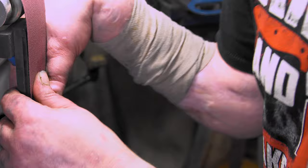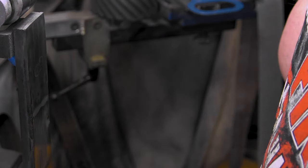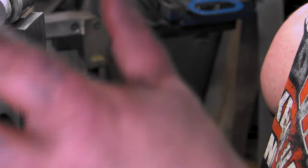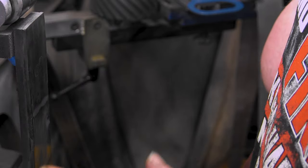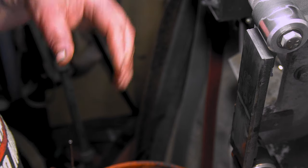This video is gonna be real long if I don't. I'm just gonna go A65, just like the surface grinder. A65, A45, A30. I might skip A45, but we'll see how it looks. So A65, A30, then we'll come back on the higher belts. We'll see where we get.